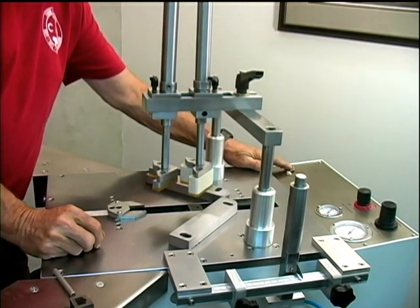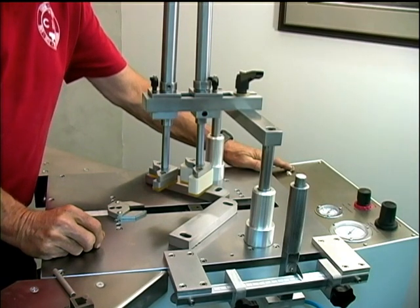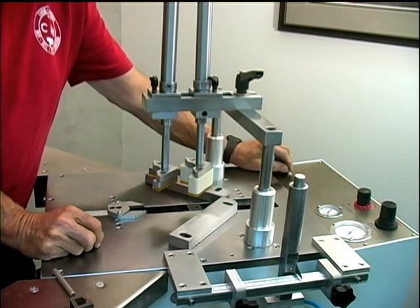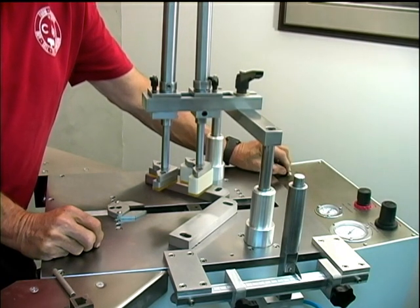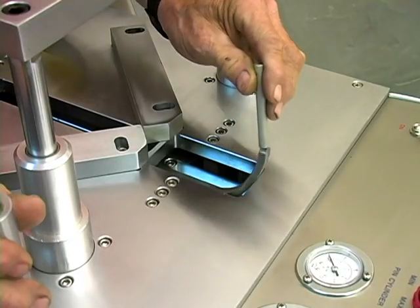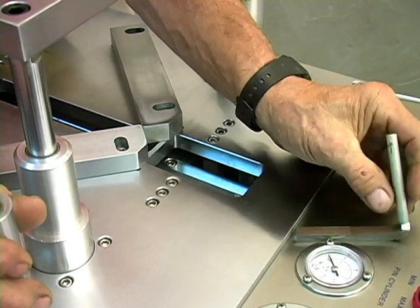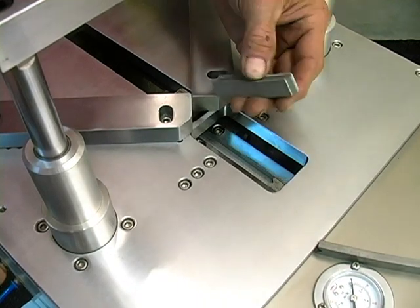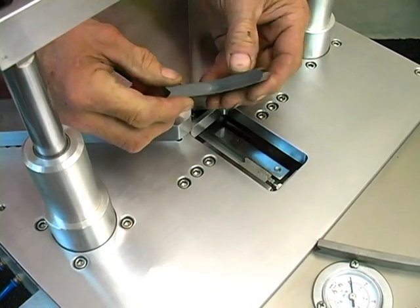The drive head size needs to be coordinated with the size of the V nails. We want to switch off pin pushing. This releases the pushing tension on the V nail stick and allows you to remove the stick easily. Once you've turned off pin pushing, you need to disconnect the air hose from the machine for safety reasons.